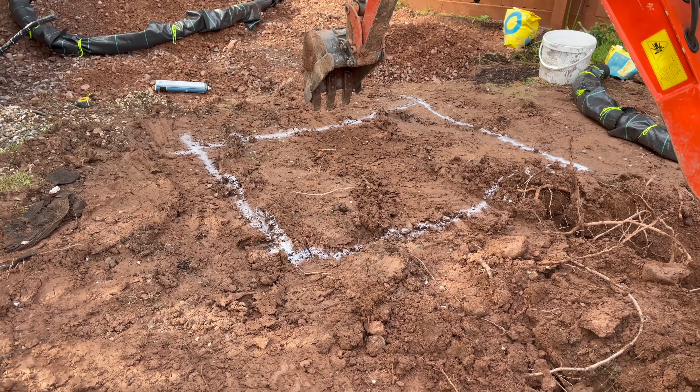Welcome back to the Tidy Bricks show. French drain — we've done the three over there. This is the last bit now. Along here we've got a sleeper wall going in between the grass area and the tree area. I put the sleepers in yesterday, concreted them down, and now we've got to put the drain in and throw all the chippings in. I'll spin it round so we can have a look at the actual soak away bit down there.